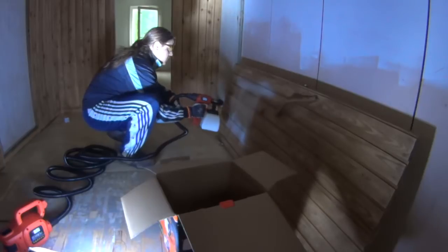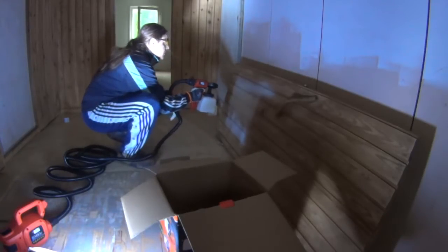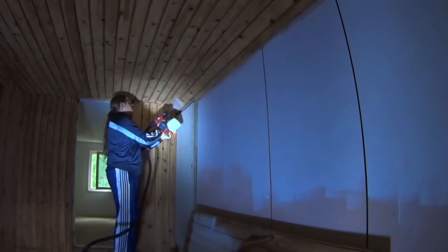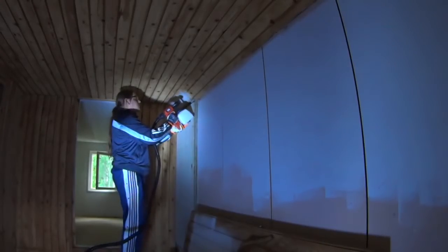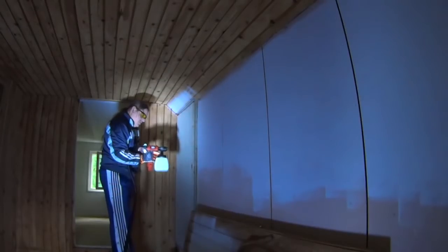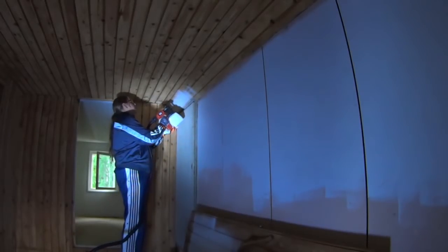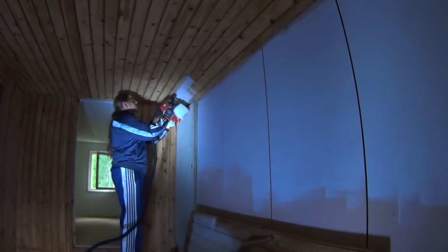But yeah, I have just watched some videos on how to paint with a paint gun, and it's very different with this one. With the high pressure paint gun that the auto painters use, you use really fast motions and really thin paints, and you will get a beautiful shiny surface with that, with just tons and tons of very thin layers. But me using latex paints, that dries really fast, and also it doesn't really come out that easily out of the gun. I had to paint kind of slowly and steadily to get a good surface.